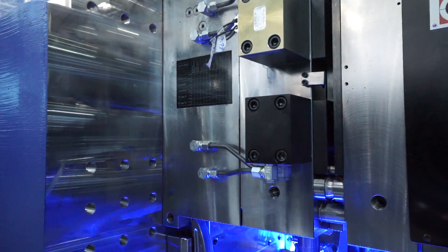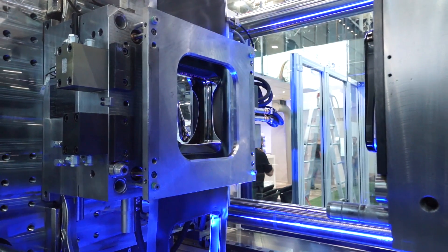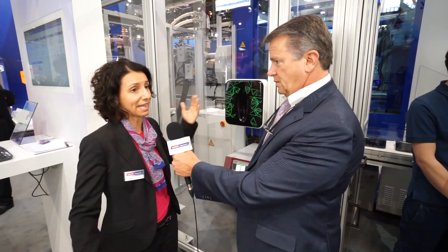I'm going to explain to you a little bit about this application. The special thing about the machine itself is that it has enlarged clamping plates for bigger molds, and it still keeps our specialty for the machines — the linear guides and also the bars — to keep the movement precise, while still making it more accessible if you have a bigger mold.